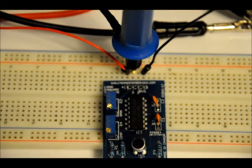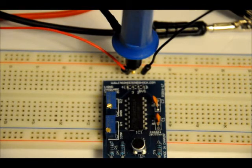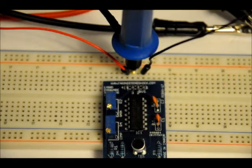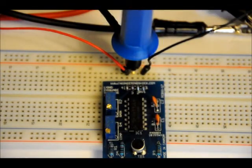You can actually read the pin out right here on the PCB. There is a 4-pin header that allows me to plug directly into my breadboard. Right now I've got 5 volts on it — 5 to 9 volts is ideal. We want to change our gain using the 50k gain variable resistor.